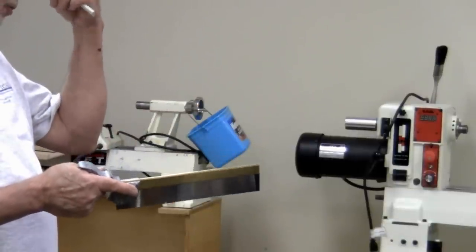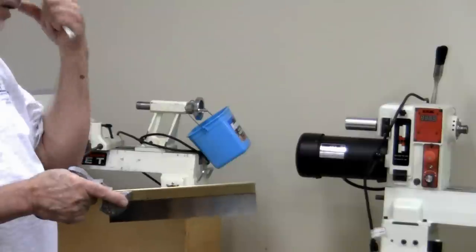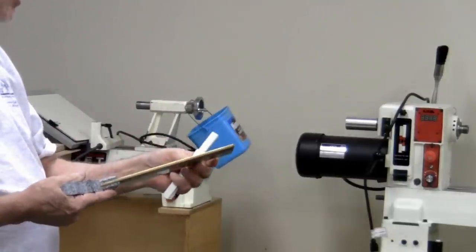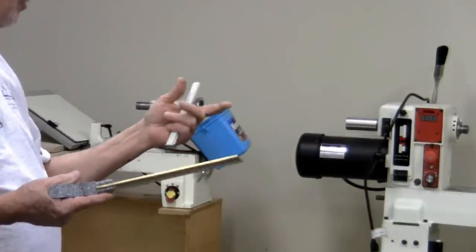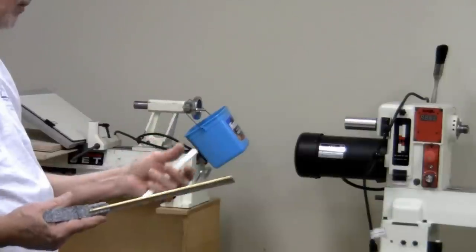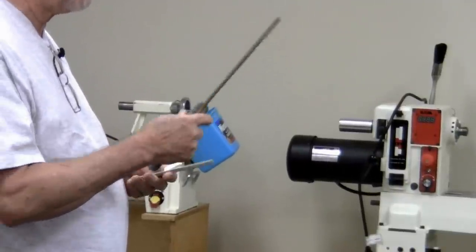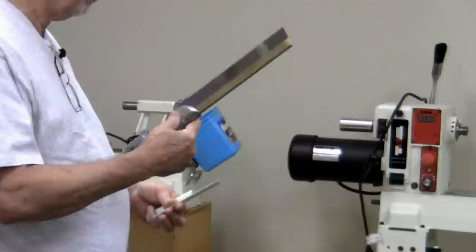Once I can get you to see with your eye where the saw needs to go, your brain can then tell your hand what to do. By relaxing your hand, you don't torque or move the saw away from where you want to start to cut. You can actually split a score mark with a marking gauge. I guarantee you, that's how you do it. And when you get finished and you chop out the waste, you put the pin and the tails together and it fits. So that's why I spent that much money, because I had cut a lot of dovetails, but they didn't work where I wanted them to be. And so I tried this guy's saw and immediately saw the difference, and I said, I gotta have one.